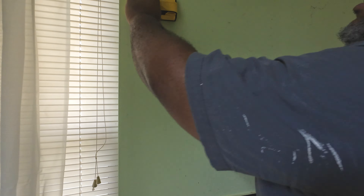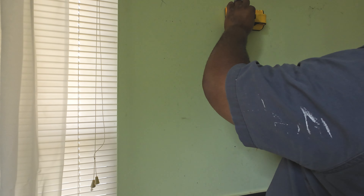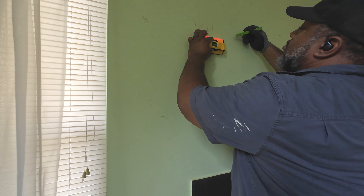These were put in when the house was built, so they use the ones with the stab connectors in the back where they stab the wires into. So if I've got plenty of wire in the box, I just cut them off and get them up out of there.